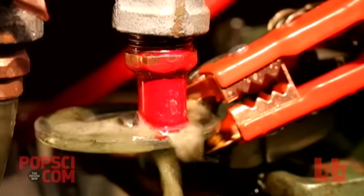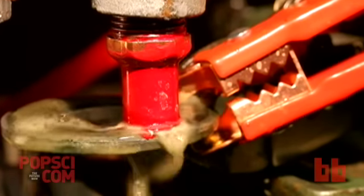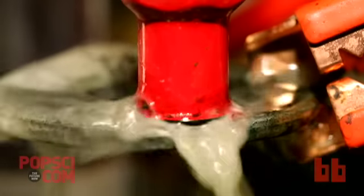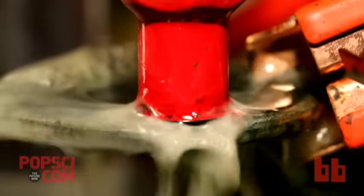This is basically like electroplating, except running in reverse. Instead of adding metal onto a surface like you would when you're electroplating, instead we're taking it away by running the current in the opposite direction. When you look closely, you can see little bubbles forming around as the water is flowing through. That's actually the water being split into hydrogen and oxygen, which is a relatively harmless side effect of the electric current.